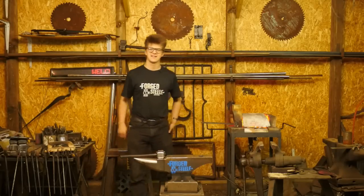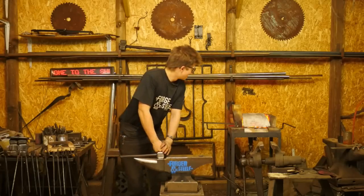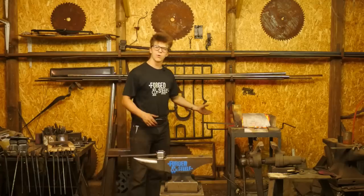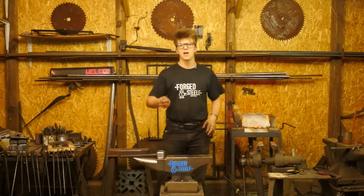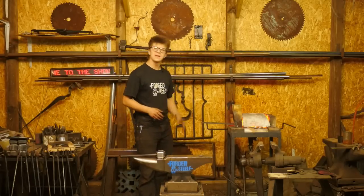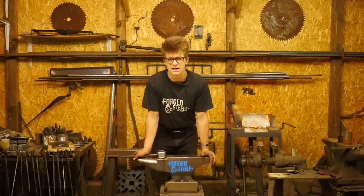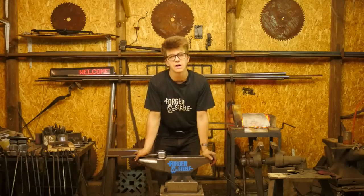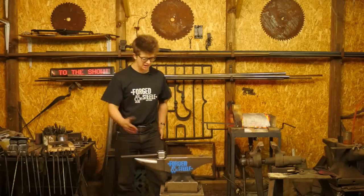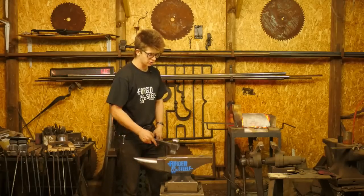It's exciting stuff, guys. So, of course, a little bit of context as to what's going on. I know a lot of people are curious about equipment. Using a gas forge, so this is powered by propane, running off an Amal Long Venturi gas injector, whatever you call it, and it's keeping that forge pretty hot. Heats the steel up pretty fast. Here are the anvil. We have a 51 kilogram Brooks anvil, which is certainly a very nice anvil to work on. The edges do tend to fracture quite easily. This one has welded up edges, and of course, right now, I'm just swinging a 3.5 pound rounding hammer, little square circle rounding hammer that I make,